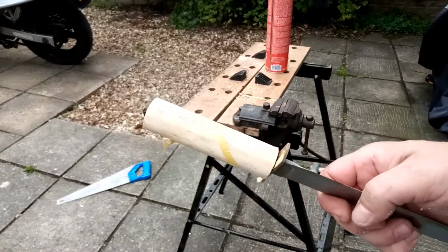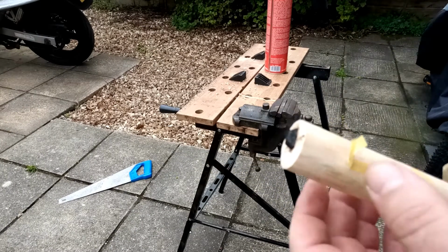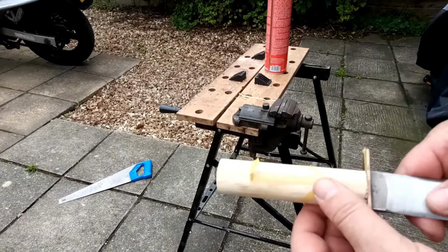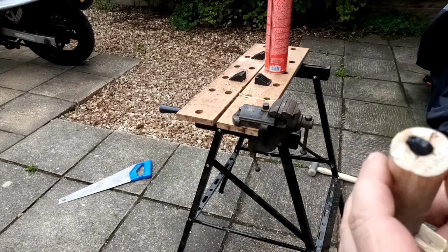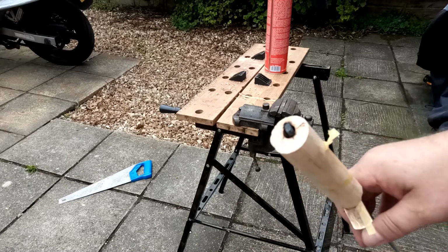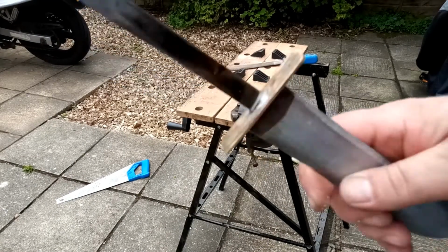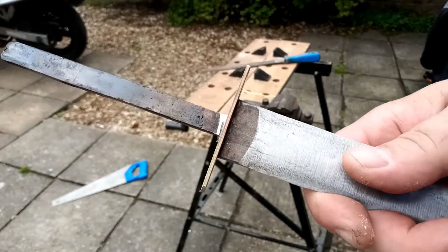What we're going to do is take it off and fill it full of glue, put it back on. I was going to try and put an end cap and peen this bit over. I think with this setup, frankly, peening stainless steel is probably a no-go. So I'm going to put the brass cap on and then get some small brass screws and screw it into place and then peen those over. I think that'll look quite good. And to get a really neat fit, I've had to file down that solder as well so it's not all bubbly.